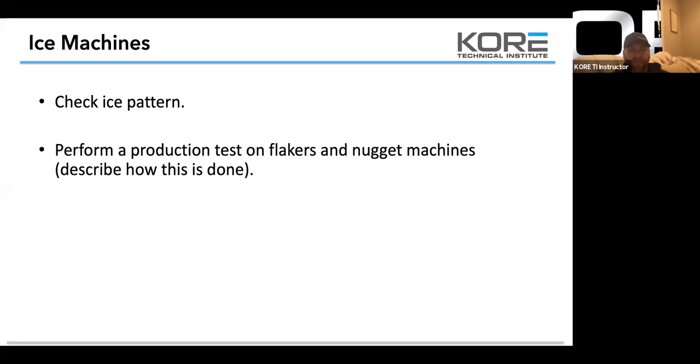Make sure, let's get a mixing valve on that machine. And that's from our northern regions. That's Denver, Idaho, Utah, Wyoming. We're seeing a lot of that, even up in some of the Arizona stores and Flag and Snowflake. So we want to make sure if you're dealing with a Hoshizaki, that your water temp is sufficient for the harvest.